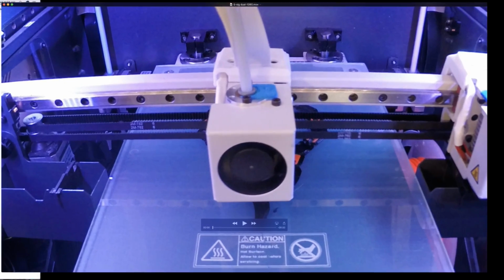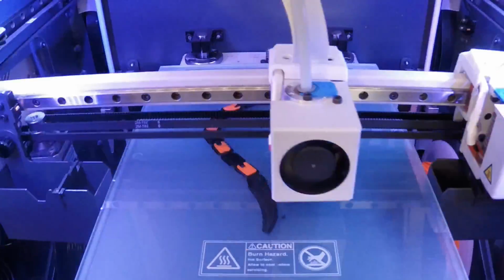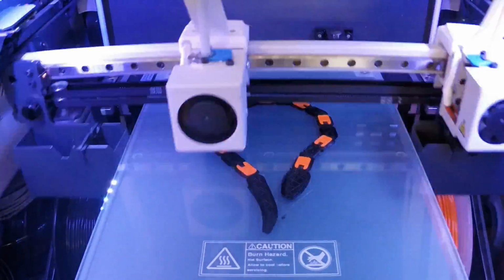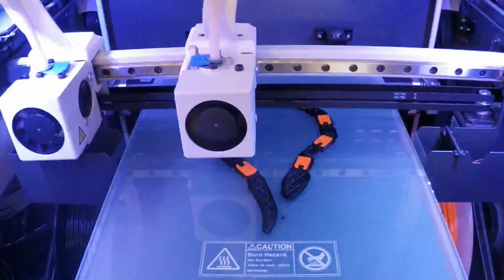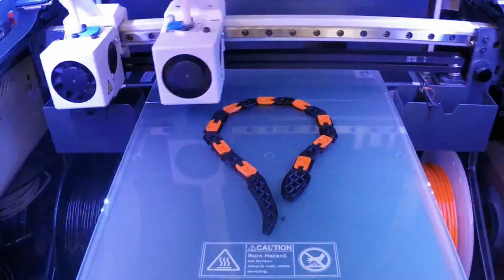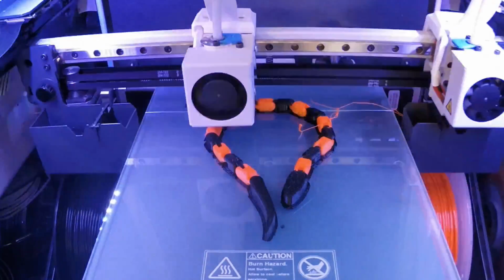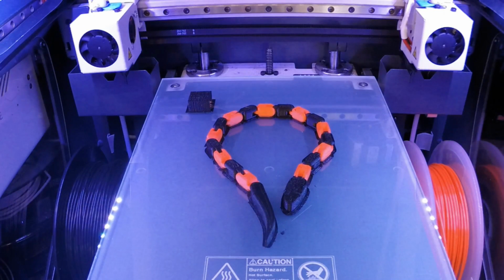After that, you tried another dual extrusion print, and with this one came success. It came out phenomenal. The oozing was almost non-existent on this. I'm using a 6.5 millimeter retraction on all these and 150 microns for the layer resolution. It came out really well.